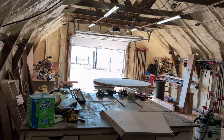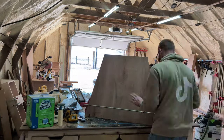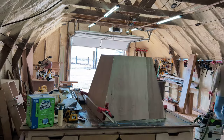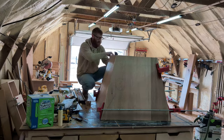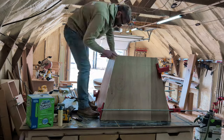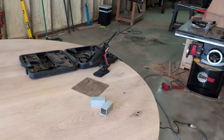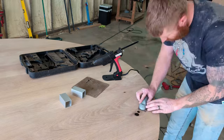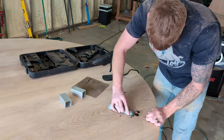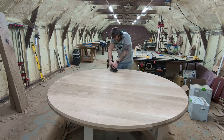It's now time for that dreaded glue-up, but taking that extra time to double-check everything makes difficult glue-ups go a little bit better. I got everything in the clamps and was really happy with how all the joints were nice and tight, with good squeeze-out from top to bottom. While the base was in the clamps, I focused back on the top — filling any cracks, knots, and voids, then taking out my sander to get everything nice and smooth.